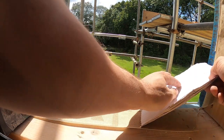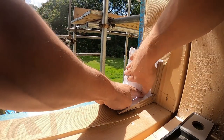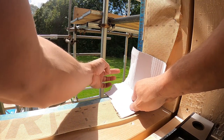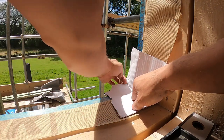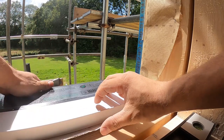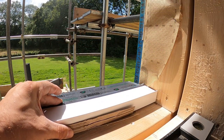So forming a turn here in the corners, you'll have to bend it like so, then that would go under the tile, where here you would notch it out, so you have about 50 mil over the side, so it's not cut flush. Same with that, and then this edge you fold up so there's no water coming in.